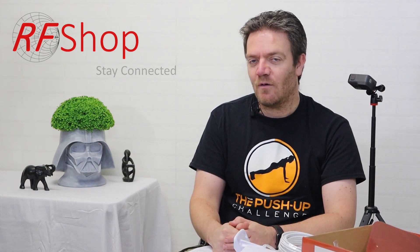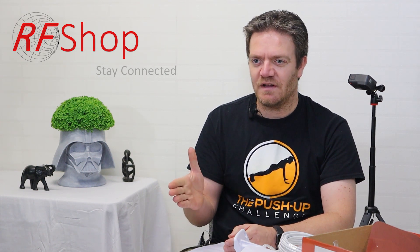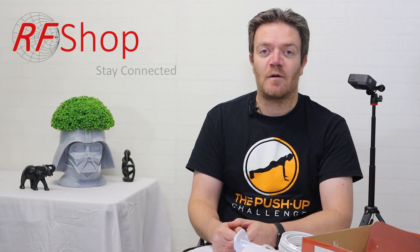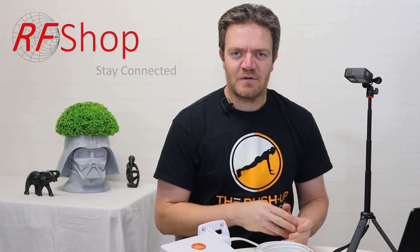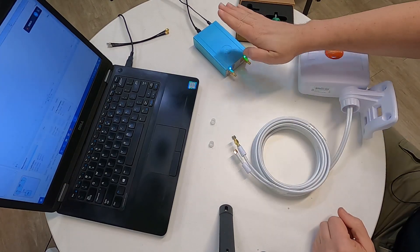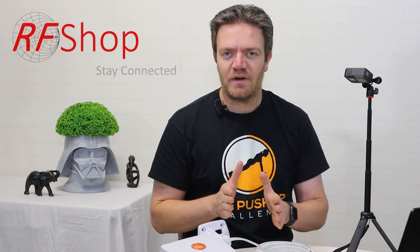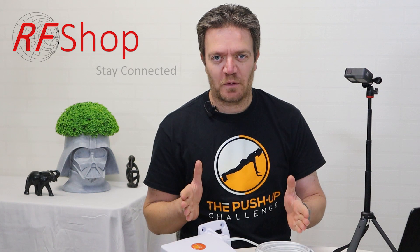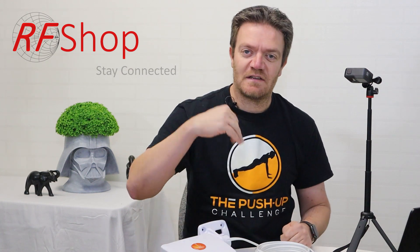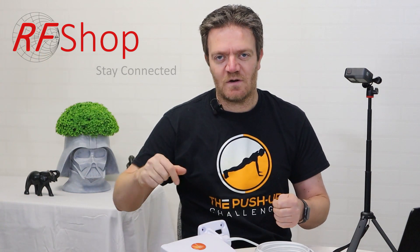So I'm super excited about this antenna. What I'm going to do now is connect it to one of my test machines to show you the return loss and VSWR. So I'm using our MediQ test VNA that we use for all sorts of work, and I want to see if this antenna is really impedance matched over the frequency band as advertised. Basically, return loss means the antenna takes the energy and doesn't just reflect it back into your radio — it actually takes the energy and passes it onto the outside world. I terminate the other port into 50 ohms so any coupling is not going into an open port.